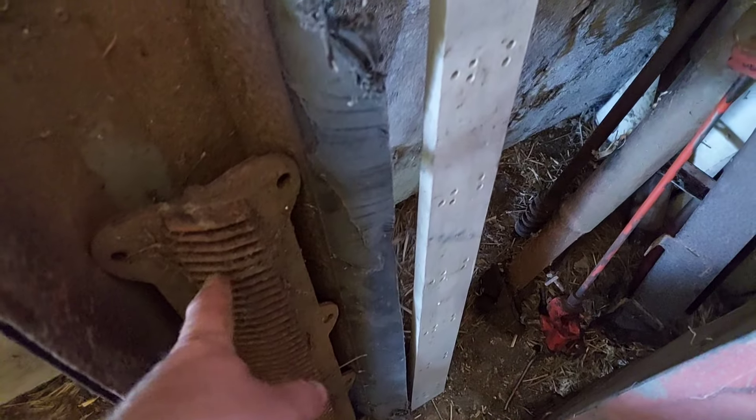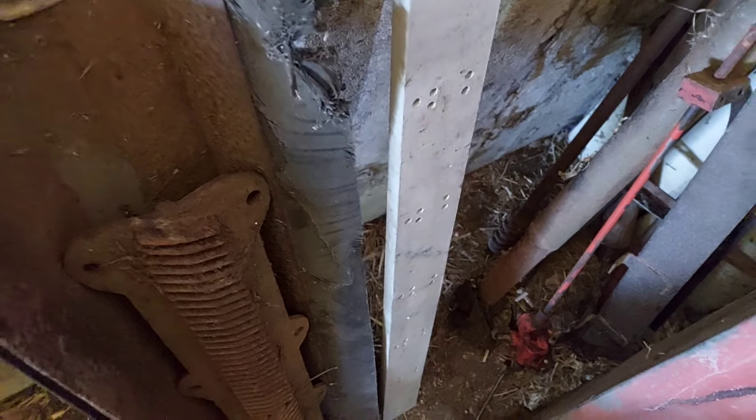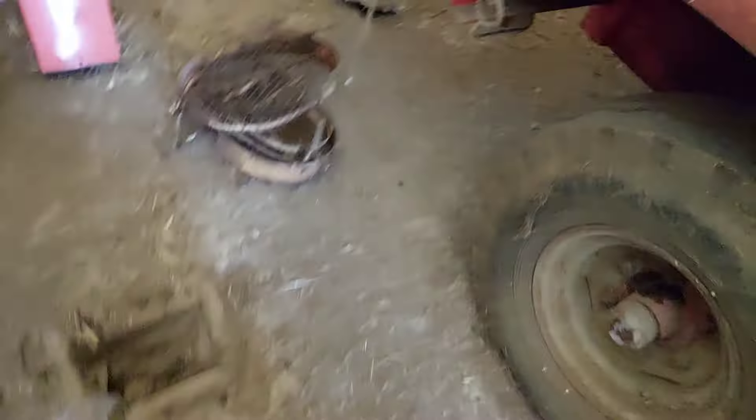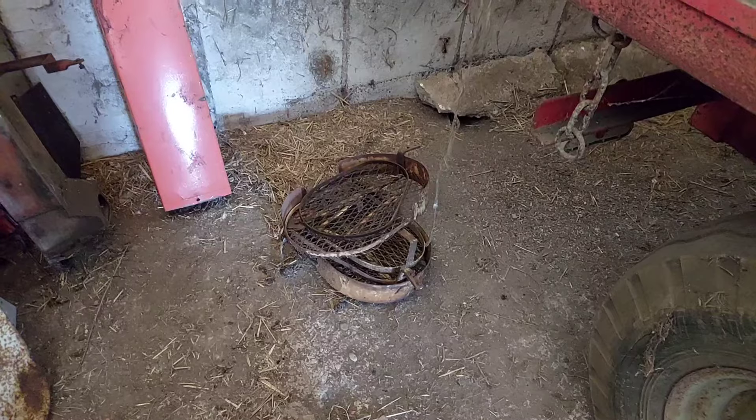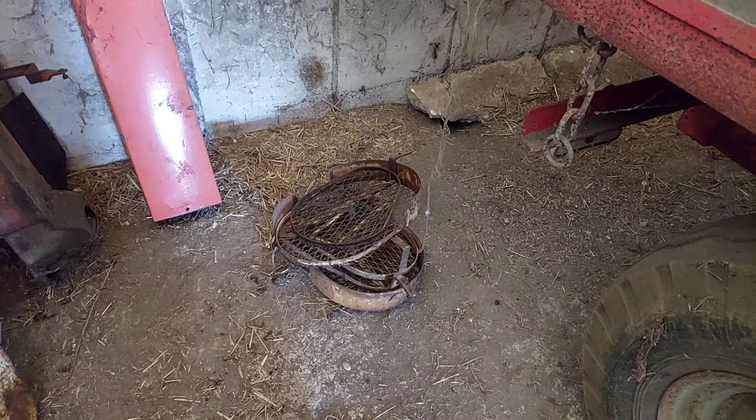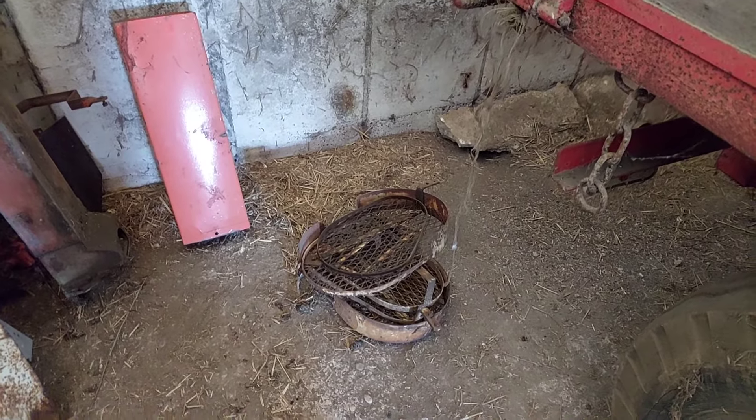There's a header control switch - hydraulic control switch for the header. Reel and header, that's from Model A. That's a rasp - there's only one, it's never been used but it's been snapped in half and somebody's welded it, so it should be alright if anybody wants it. That's a drum cover, Model A. That's an intermediate reel drive belt cover. A few belt guards. Unloading auger engager. Reel tensioner guard for the reel belt. Upper and lower sieves - they are rotten, but there's bits on there that can be used, I think it would be negative to throw them away.